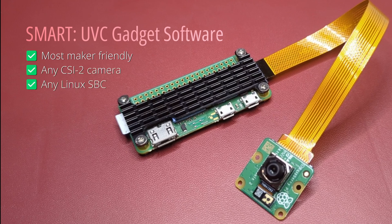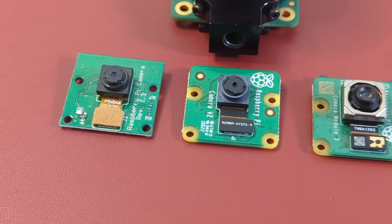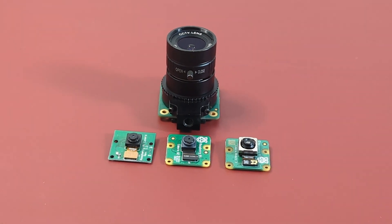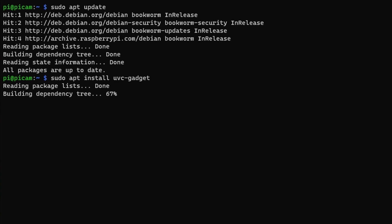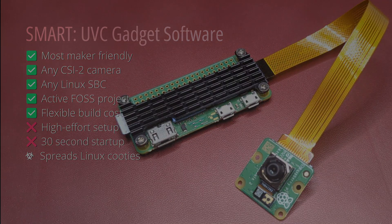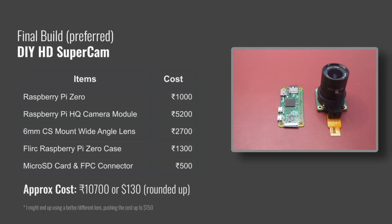The third build with software UVC setup is the most flexible, configurable, powerful, and maker-friendly option. It works with any camera module and Linux single-board computers. Most importantly, after being adopted by the Free Desktop Foundation, it's the most reliable and future-proof device-independent solution — the backbone for all derivative UVC peripheral software. However, it takes the longest to set up and about 30 seconds to power on each time. It's a great project but a terrible commodity; it's the poster child of everything right or wrong with the Linux ecosystem. For these reasons, the ShowMeWebcam option comes ahead in both cost and convenience.